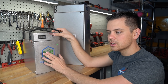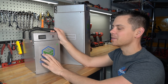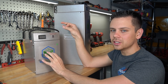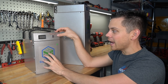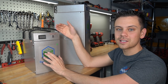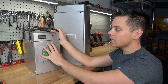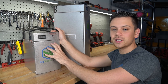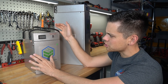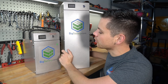These should last 5 to 10 years or longer — theoretically 15 to 20 years, though I'm not going to count on that. Even when these batteries are at their limit you can still use them. You'll have reduced capacity but around 80% — with NMC cells you'd probably be at 60 or 50% capacity and have to rebuild your battery bank. Once you hit 80% you can still safely use these. The longevity of lithium iron phosphate is really nice, and these actually have a 10-year warranty.